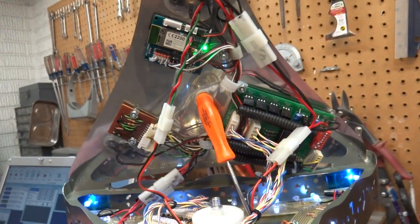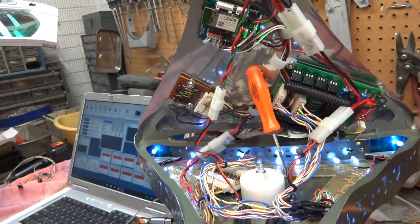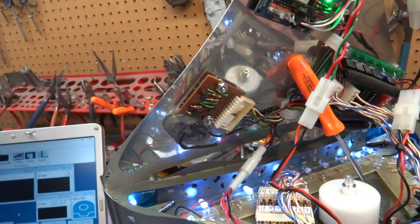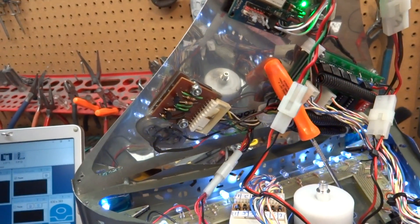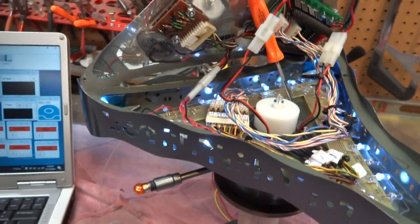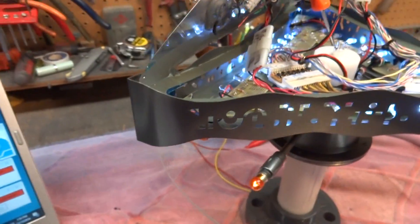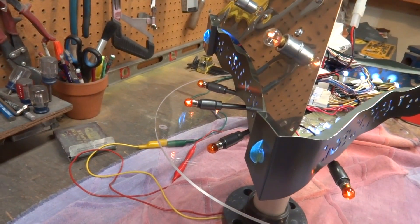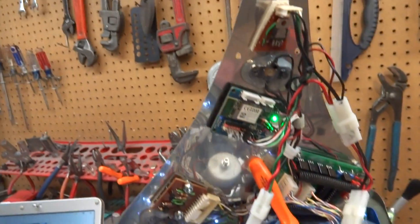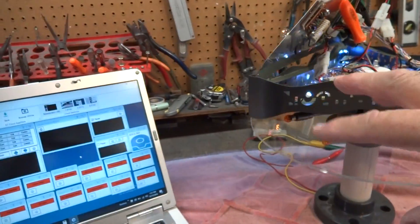Just to give you an idea of what I have in here: this is the light control board right here that operates all the lights and the special effects of the lights. This is a transistor board I built to turn all the light special effects on and off — there are just two of them that operate up in the brain. This is a diode board right here that gives the finger lights a nice random look as they blink on and off. Up here is another transistor board that I built that turns on the crown motor that lifts the fingers up and down.